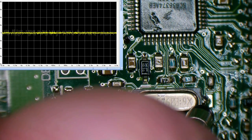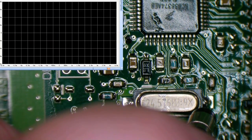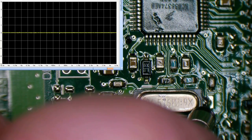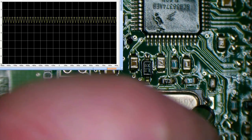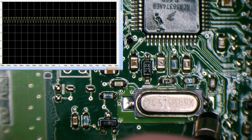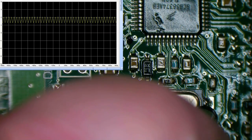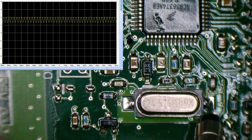And if I get some power on the go, that's off the charts. All right, let's come back down a couple. It's probably got a DC offset on it. Oh yeah, that looks like it's oscillating, which should be around 24 megahertz according to the top of it. Frequency is 25 megahertz, that's close enough. 24.5.